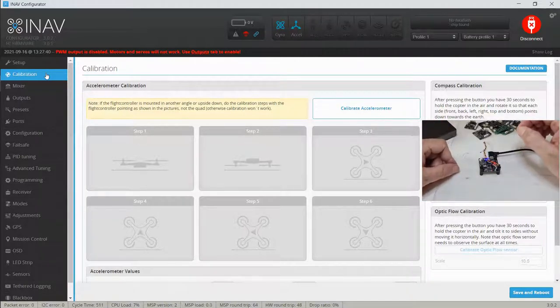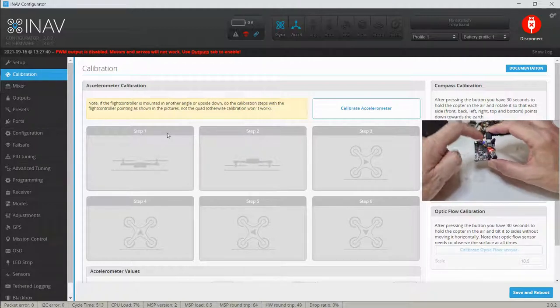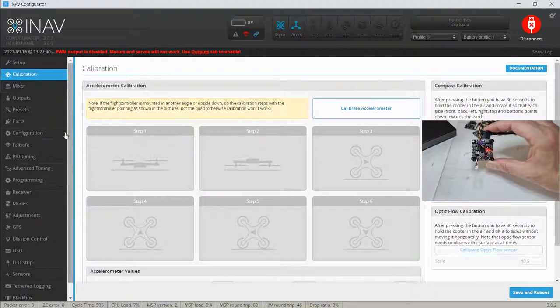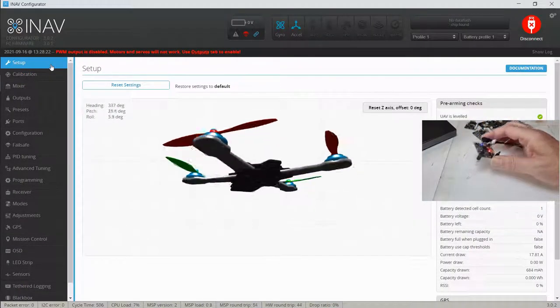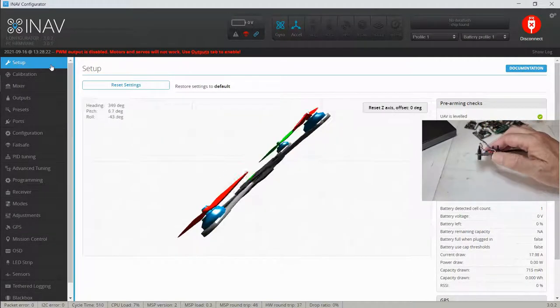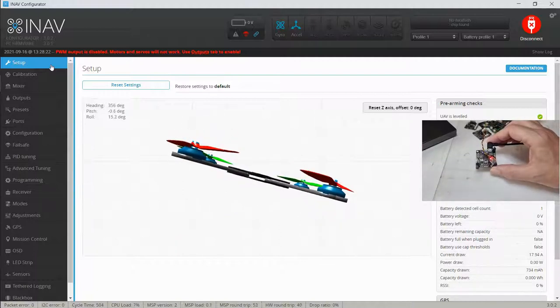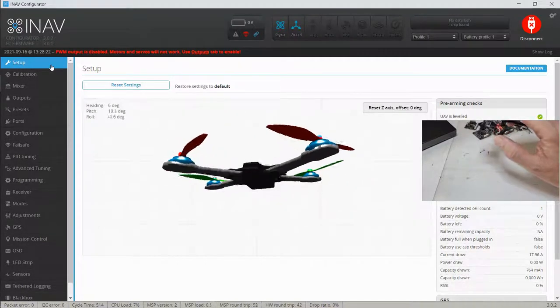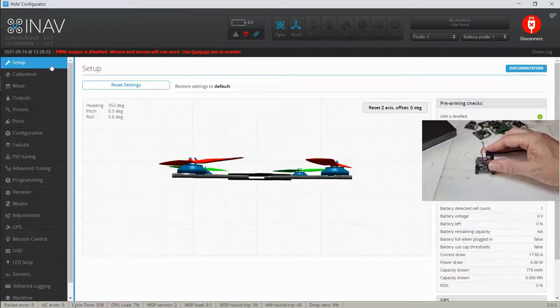On screen you can see it's grayed out with Step 1, Step 2, Step 3. It doesn't matter which way around you do this — it senses what you're doing and adjusts for you. The arrow on this board is pointing to my right, and on screen when I point the arrow to the right the quad goes forward, so our arrow is pointing the correct direction. It should be simple, but sometimes you do have to adjust the orientation.